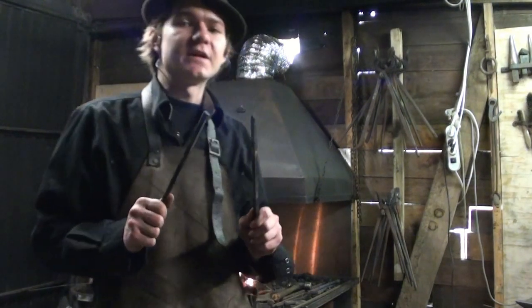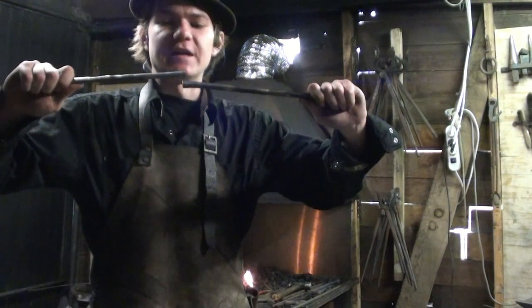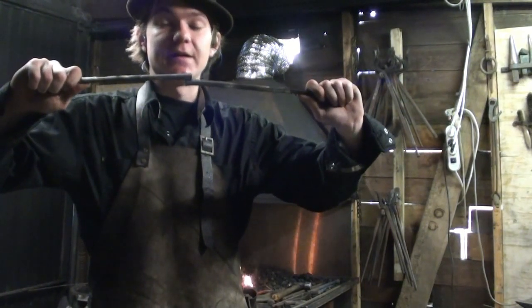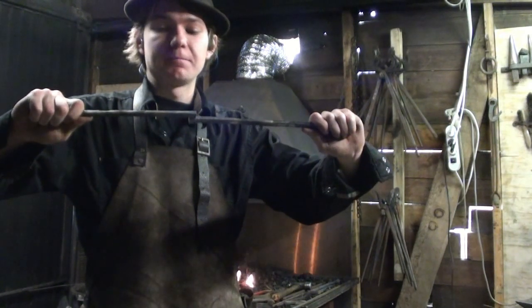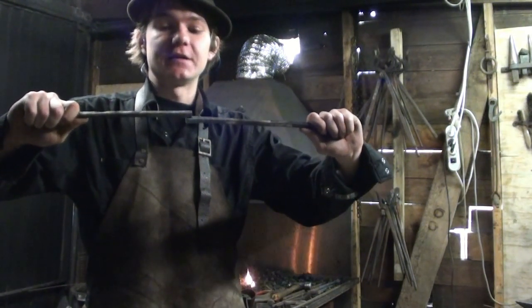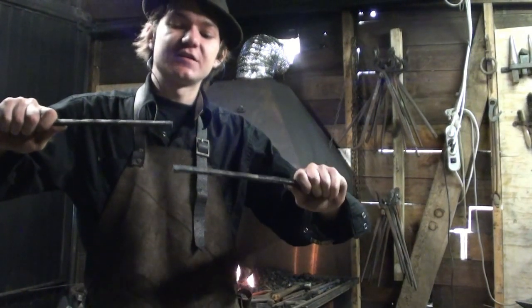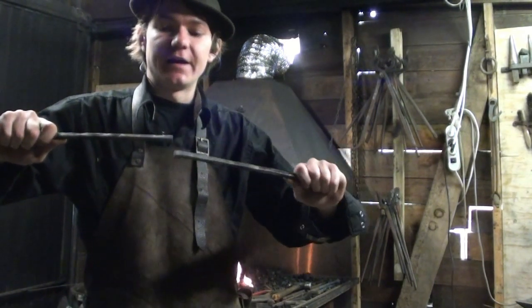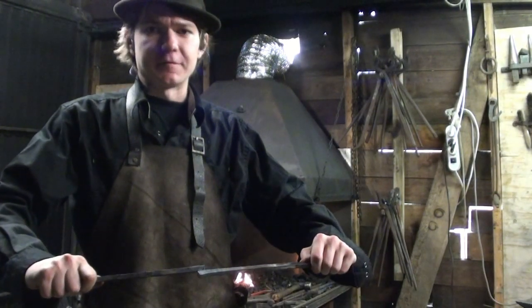Okay, now that I'm done upsetting them, I will have to scarf them so that they will overlap well and then I can weld well. Because I could weld them like this, but there are pretty high chances that they will stick and then they could break off later, because there's a big portion here that is not touching the rest and also the bottom piece. So I will have to scarf them.